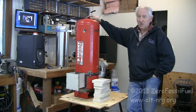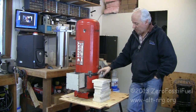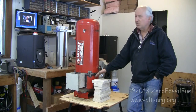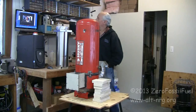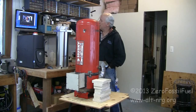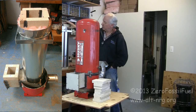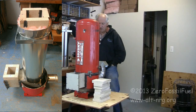It is completely serviceable. I made it so that it can be taken apart, put back together, change out the fire bricks, etc. This stack of bricks right here are the bricks that create the firebox inside the lower portion of the J-tube inside the rocket heater, and back here you can see inside the 8-inch galvanized pipe I have the three sections of flue stack assembled, and I have insulation already stuffed in there to insulate the sidewalls even further and create a much hotter burn in the flue stack.